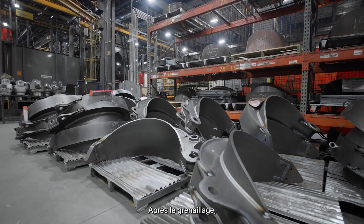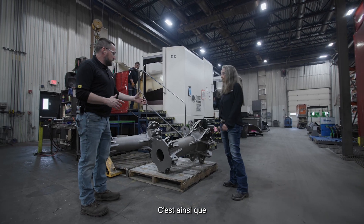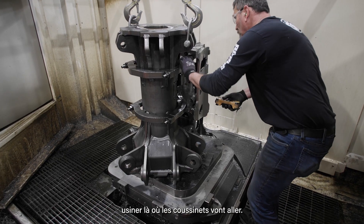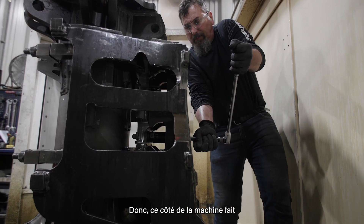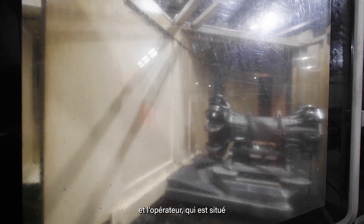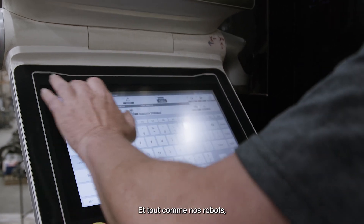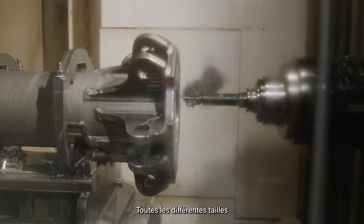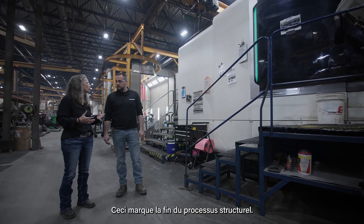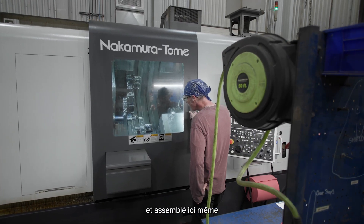From the post blast, we move on to what we call our pallet — we machine the jaws and heads over here. This is how it starts out: it comes out of the blaster, ready for machining — putting the bolt patterns in, machining out where the bushings are going to go. This side of the machine does all the loading of the product, and it has a rotation table where it turns. The operator, located on the other side, does all the machining. Just like with our robots, these all run by programs — every different size head and jaw has its own program to run that specific requirement. This is the end of the structural process. Now we'll look at accessories — from our cylinders to our pins, all machined and put together right here at Rotabec Groveton.